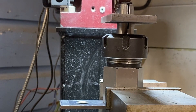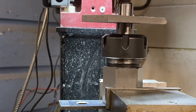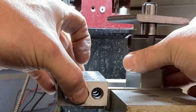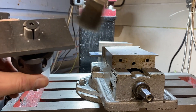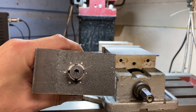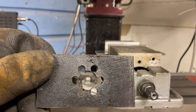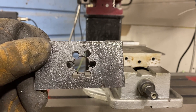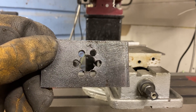With the holes started, I can take the piece off the mandrel, take it over to the drill press and simply drill the holes out. With that, I have created a nice hexagonal pattern that will allow me to drill it out to make my splines. The measurements came out good as far as from the outside to the outside. If I had it to do all over again, I would have used a smaller mandrel. I used a bigger one because I thought it would have better holding power, but it made it a little harder to do my dimple drilling and it broke through on all six of the holes. Had I used half inch instead of five eighths, I wouldn't have had that problem.